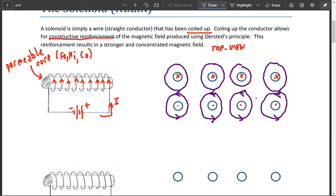You can see those arrows inside are pointing to the left and outside they're pointing to the right. Take your thumb for the top part, point down, then wrap your fingers around and you'll see it goes like this. Now, even though the current is going down at this point, the magnetic field that's being produced is also pointing to the left inside, and outside is pointing to the right.